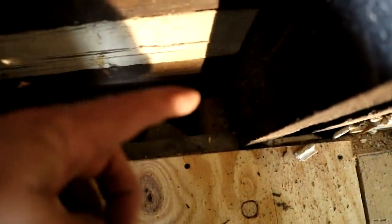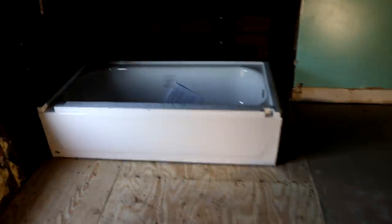One issue I found is one of the floor joists, so that's coming right where my drain needs to go through the floor. So that's a bit of a problem. I wanted to have this pulled out 3.5 inches, and I was going to frame a little section of wall here. To where if you ever have to remove the bathtub, you can pull it right out and then insert a new one and not have to get into knocking the framing loose to do so.